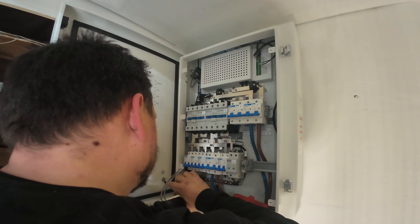I hope you found this video interesting from both a consumer and an installer's perspective. We've tried to show how easy this is to put into play — it's just a case of sitting them on top of each other and screwing it back to the wall. There isn't a great deal in terms of cabling between all of the products: you've got your data link cable between the inverter and the gateway, your PV inputs, your AC cable, and that's about it. We did the RS485 link wire as well but you don't need that if you're linking through a Cat5 or Cat6 cable between the gateway and the inverter — so we've been able to disconnect that. But you live and learn; it's the first one we've done.